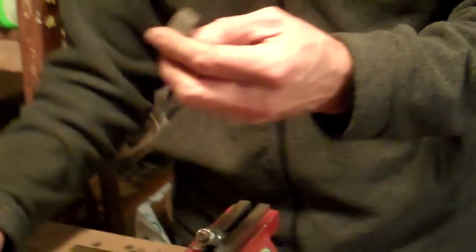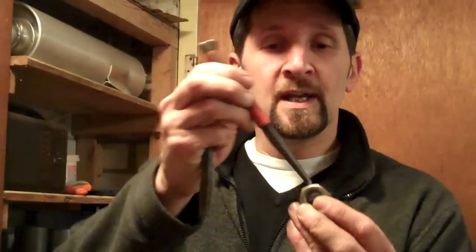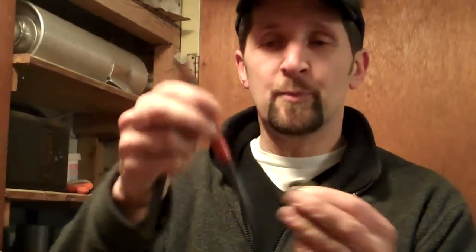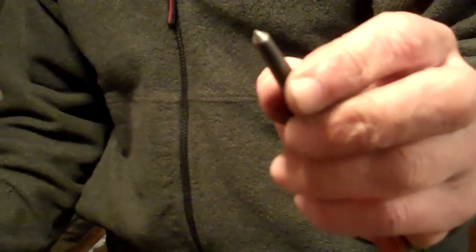If it's a big nut or a wheel nut, use a chisel — that will get a better grip. Use the center punch to start, and once you've got a little space, switch to the chisel. Two good tools to buy: a decent quality center punch and a decent quality 10mm chisel. Get them on the grinder and keep them nice and sharp — they work better.